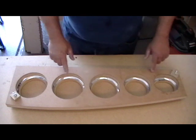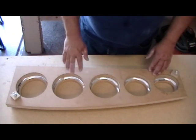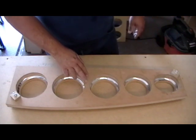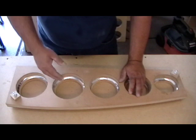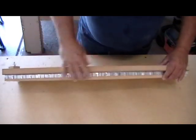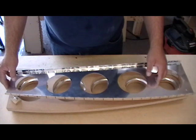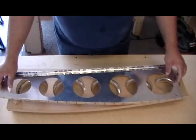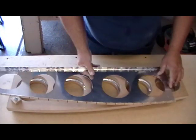This is the center rib of the wing, and this rib sits between the forward spar and the aft spar. There are not nearly as many of these in the wing as there are nose ribs, which I showed you last time. The process for forming these ribs is essentially the same — they're clamped in the form block and flanged over on the sides. You can see this one's already done. The next step is to flange the lightening holes, which gives the ribs compression and torsional stability.